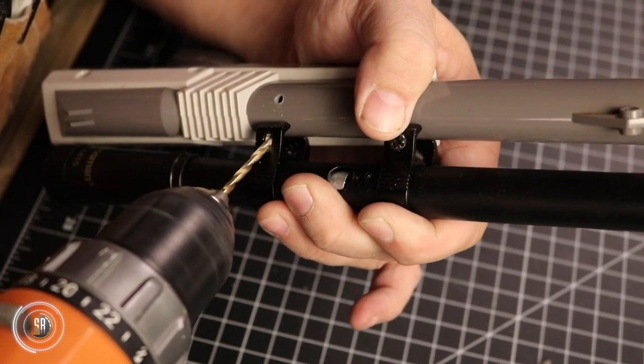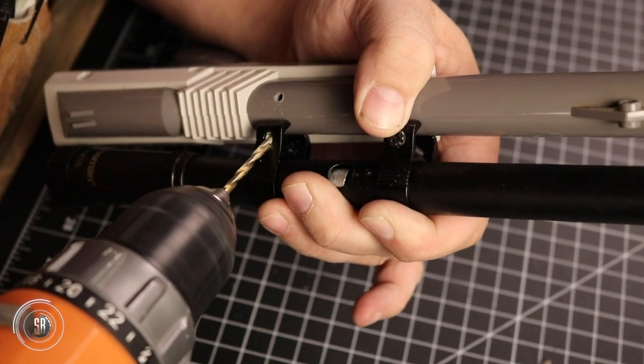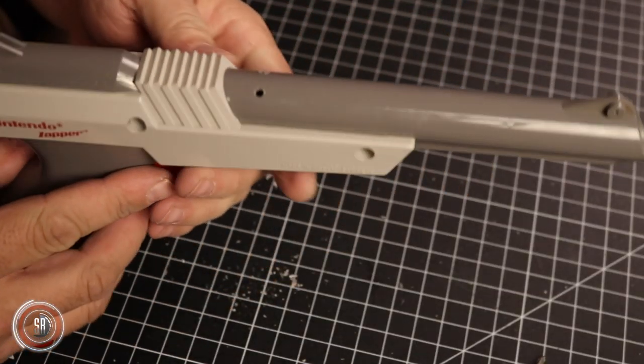Little smuggler safety tip here for you: when I drilled into the Zapper Gun, I had the scope mount braced firmly against it, but I was drilling towards my hand. If anything would have slipped, I would have jammed the drill bit right into my palm, which obviously is not the intent. In hindsight, I wish I would have marked it, then put it into a vise, drilled through the Zapper Gun, and then assembled it. So, not following me on this would be a pretty good idea.